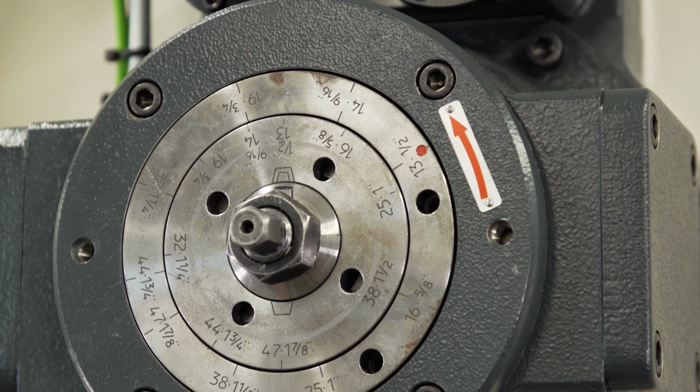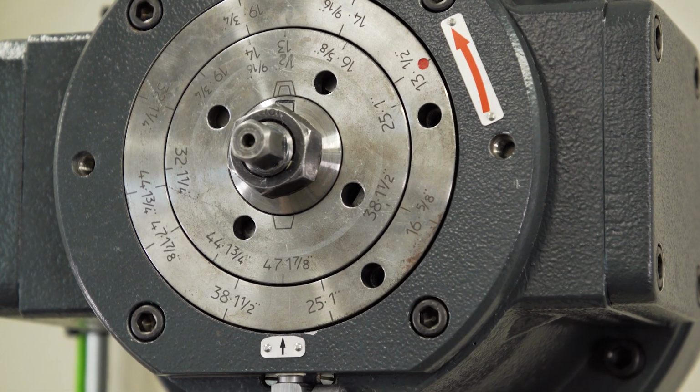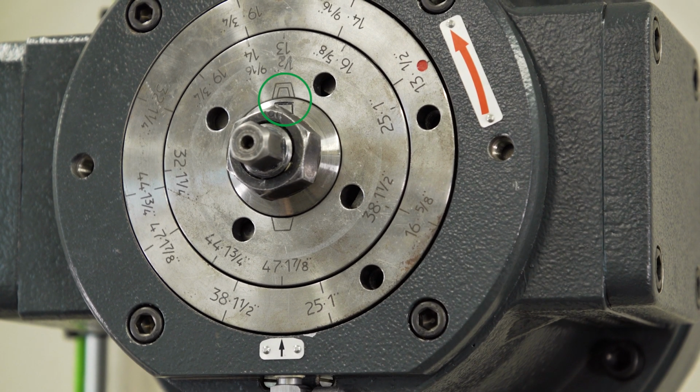Should you have difficulty engaging the switch bolt, rotate the special Bruderer key by just 1 or 2 mm to the left and right until you have found the lock position. The mark bolt in shows that the switch bolt is engaged. With this step, you have found the lost stroke and set the machine to the required stroke.